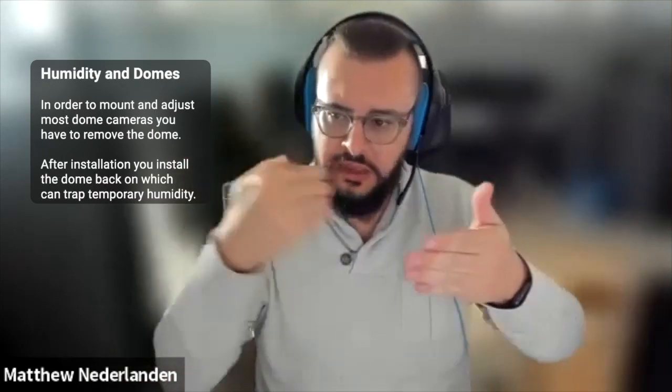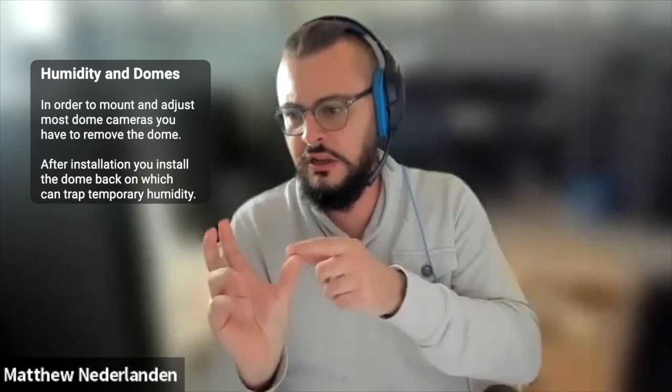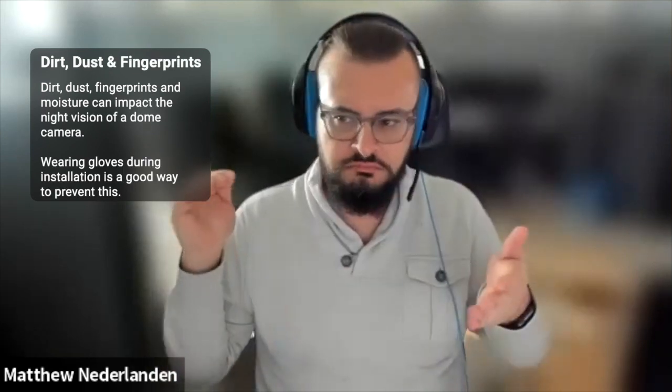For advice: if you are DIYing this and you're going to put it up at your small business or your home and you're the one installing it, use a turret. It's a way better plan — it's so much more forgiving. What I mean by that is, inside the glass dome you have air, so when you open that up you're going to have air that gets inside. If you're doing this on a really humid day, you're going to trap moisture inside of it. The IR is going to hit that moisture and bounce back into the camera. When you're taking that dome off, you're putting your fingerprints and fingerprint oil on the outside and probably on the inside too, because almost everybody touches the inside by accident. And that's going to do the same thing.